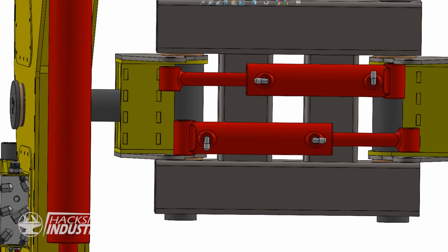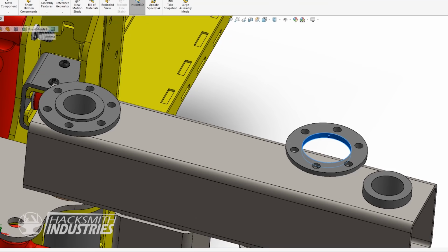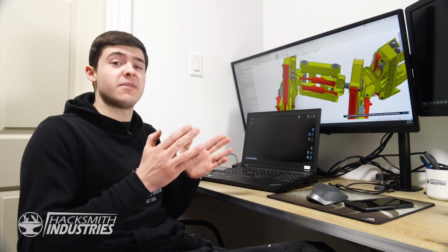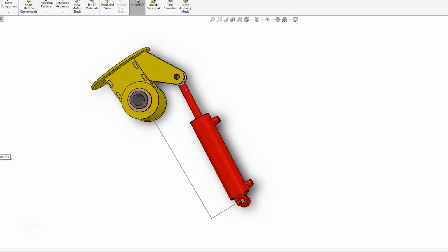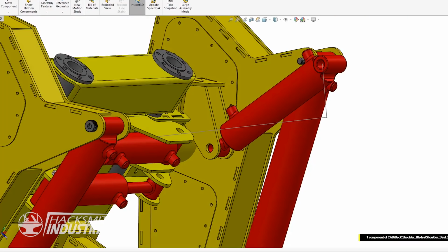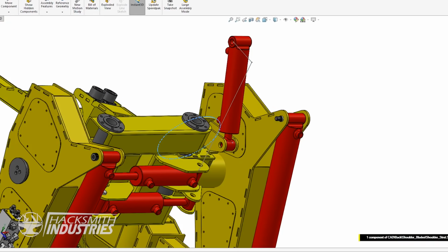The shoulders are one of the most critical parts of the power loader design, as they must be extremely rigid in order to hold the weight of both arms and whatever you're picking up, as well as be extremely precise to allow the arms to be very accurate at the very front of the gripper. To save us time on the design, I'm actually gonna reuse all the math from the wrist joint in order to calculate and figure out the linkages for having the arm pivot up and down.